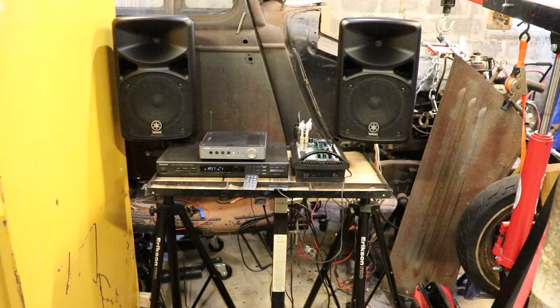This is all stereo equipment, which was very intentional — I do not like surround sound for listening to music. It's a nuisance trying to get the settings correct, and when you think you've got it right it screws up. For a garage where you want to listen to music, stick with stereo. Don't buy some thousand-watt home theater contraption. If you go too old, like an old THX system, you're probably looking at replacing capacitors and reworking circuit boards, and they're very bulky.